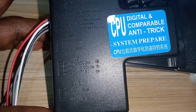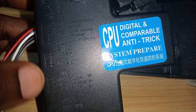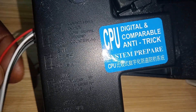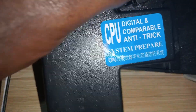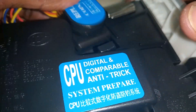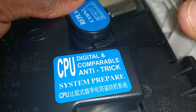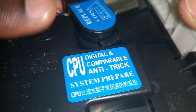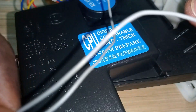Taking a closer look, the gray cable is a counter minus or counter plus — it senses and compares if the inserted coin is the same as the one in the sample slot. The sample slot is here; the coin inserted must be between 22 to 28 millimeters in diameter. When the inserted coin matches the sample, you get a plus 12 volts output which can increase or reduce the counter.